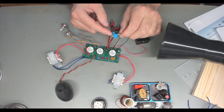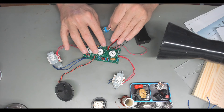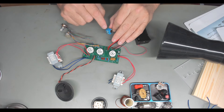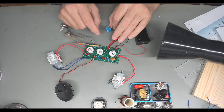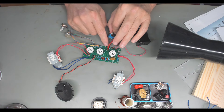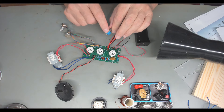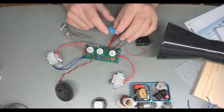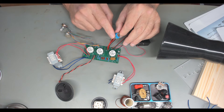If you remember the last video when I installed this switch — what's odd is this looks like it should go on the board because they have slotted slots for these lugs, instead of circles for wires. They've got a shape for this to go on the board, so it makes you think it should. But when I put it in, I mentioned how it was very snug. With six pins going through the board and being snug, I had a heck of a time getting this out.